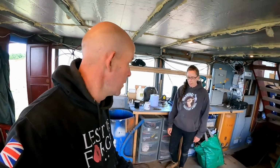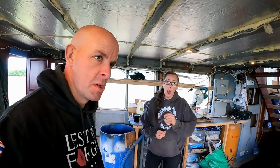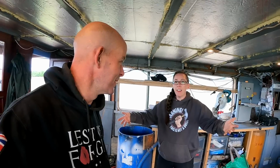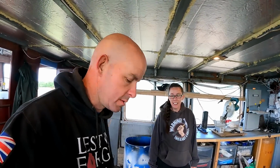Right, so we're now onto the template stage of the apron. This is where the comments say you should make templates with hot glue and bits of stick. I know why they're saying that, because they've seen it somewhere else. Just because someone somewhere else does it like that doesn't mean that we have to. Also, hot glue with wood very easily comes off, and we've got to take this piece of wood from the boat all the way to the van, in the van to work, 40 miles, and by the time we get there all these little bits of sticks are all over the van and we go, where do we put them? No, there is a time and a place, just not here. We like measuring and adjusting and using compasses, and that's just how we do it, because we always work on big curves in one hit.